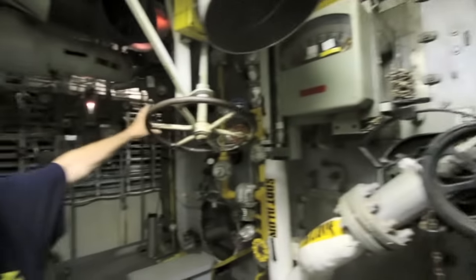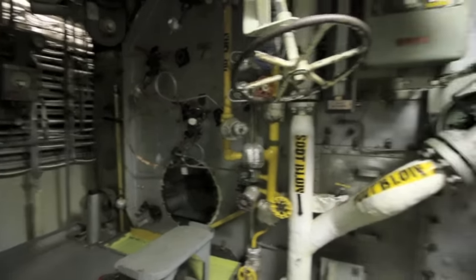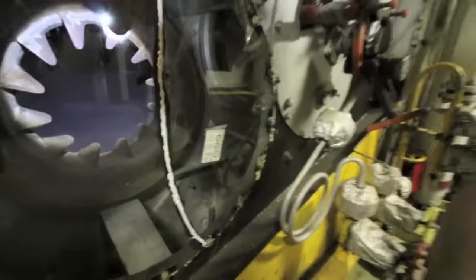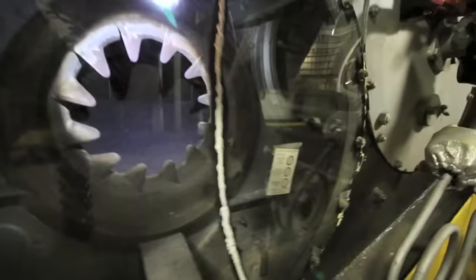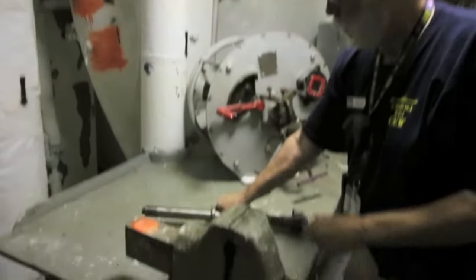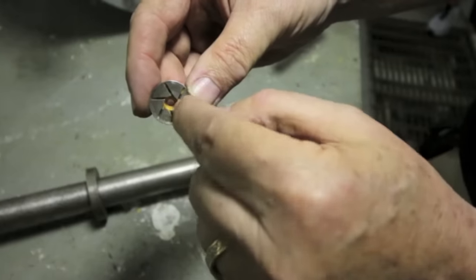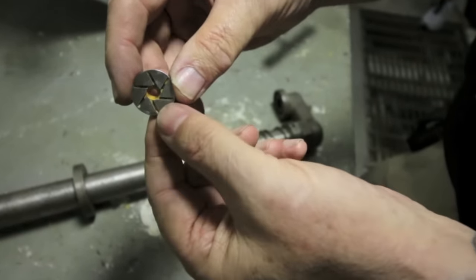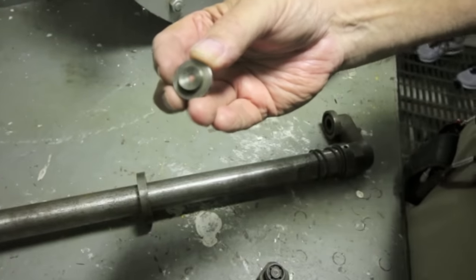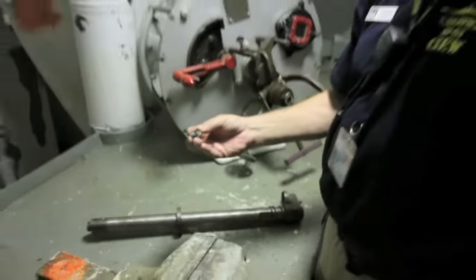The superheated side, this is the saturated side. Saturated steam is wet steam. Superheated steam is dry steam, which means it is steam with no water in it. That is where hell happens. You have what's called a gooseneck, and inside the burner tip is what's called a sprayer plate. The oil is spinning in that area that's actually called the whirling chamber, and on this side, you get a cone of atomized oil spraying out. And that cone is on fire. Big time.